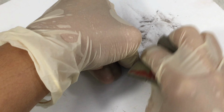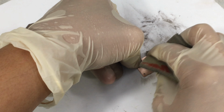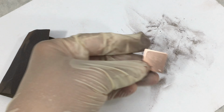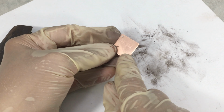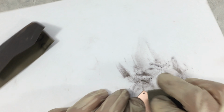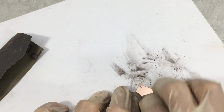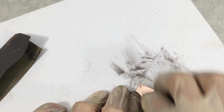But the sanding sponges, what's nice about those is that because of the give of the sponge, they'll get into any slight valleys and they'll leave a smoother finish. You look at how nice and smooth that satin finish is. And that's the superfine, which is the roughest of those 3 grits. It goes superfine, then ultrafine, and then microfine are my favorite grits for the sanding sponges.